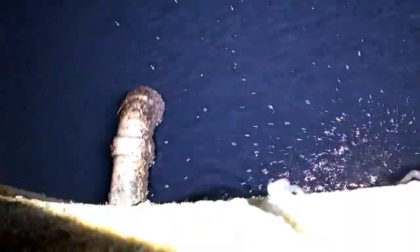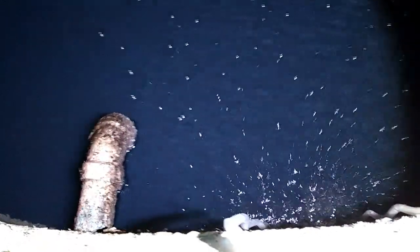Let's take a look inside the cistern — we're going to jiggle around here a bit as I bend down in there. You'll see that the inside of the cistern is coated with concrete, painted with a blue swimming pool paint. You can see a few spider webs in there. The intake was on the far wall over there, and here we're showing the aerator, which is a solar aerator that bubbles the water in the cistern. The cistern will actually hold about 5,000 gallons. You can see the overflow pipe there, which is tilted downward to flow out so that if anything is floating on top, it doesn't get caught. That then heads out when the tank gets full.